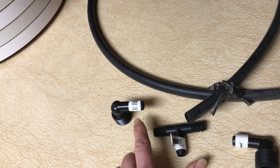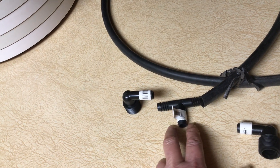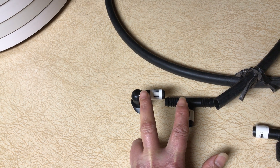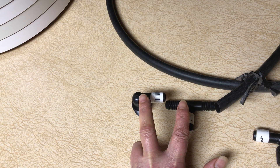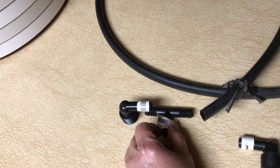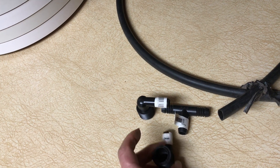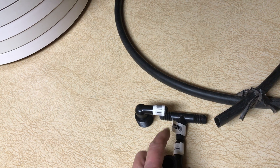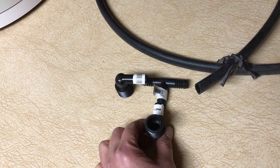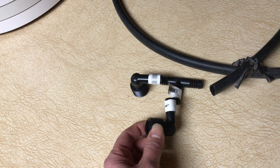Find out which piece you need, get it, screw it on, and put it in whatever direction you want. I usually use an elbow so I can bring the pipe over and put the sprinkler at the same level, so it's not raised up and going to get hit by a mower. So first, screw that in. Then I cut a piece of small Rainbird foam-type funny pipe and push it onto the fitting.